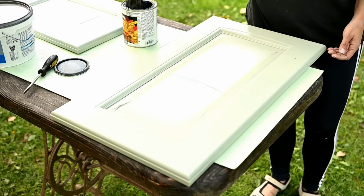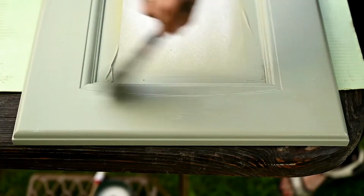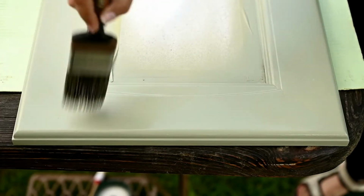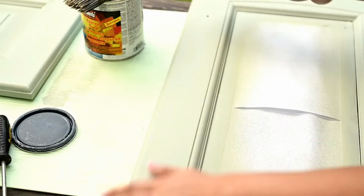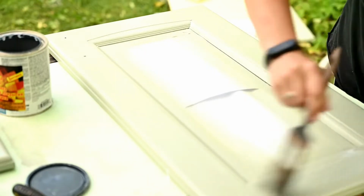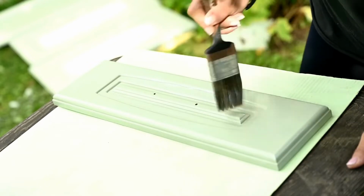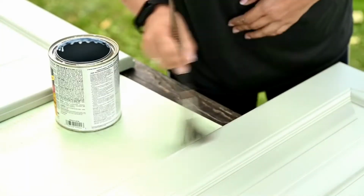After the paint dries well, I'm applying the finishing coating. Use as hard-wearing sealer as possible. A floor sealer is a great choice here as it is the most wear-resistant one. I had a leftover sealer after our kitchen makeover in our apartment. This is Marathon polyacrylic sealer and I'm applying it with a brush, since the consumption when coating with a paint spray is higher and I was afraid that I would run out of it because I had very little left.